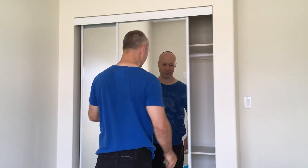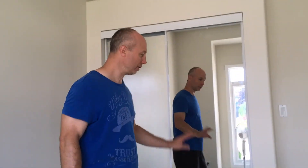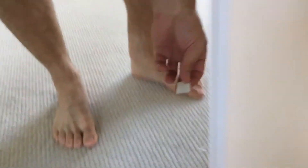The last step is to screw this in. When you screw this in, you basically want to make sure the distance from here to here is the same as the distance from there to there — that's easy to do. Peel off the plastic, which is another step. I've also got these little felt cushions — I'll put them at the bottom right here, and then when you close the door it's going to be a softer close and you're not going to hear a bang.